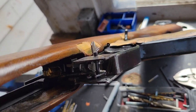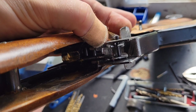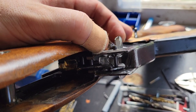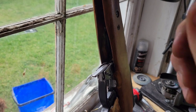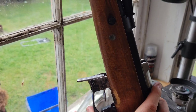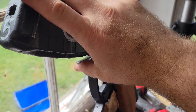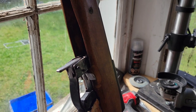One thing that needs to be taken into account is there has to be allowance made for the bolt catch lever and armature on one side of the magazine catch lever, so we'll be filing down that one side. This is the magazine catch installed now — you can see it runs with the bolt hold open locked open. Lock the magazines in and you can drop the bolt and start with one hand. Really, the magazine catch is one of the simpler parts of this build.